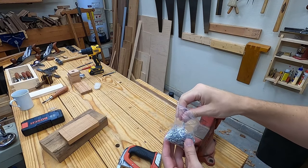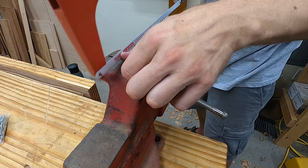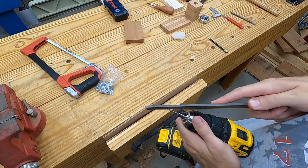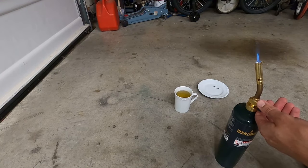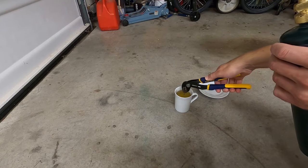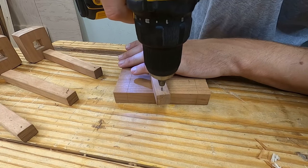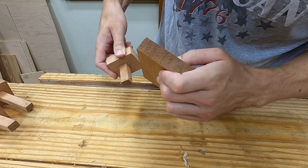Now, to make the pins, I'm going to use these carbon steel pieces. I'll put a link in the description for what I use for the pins, the thumb screws, and all the other hardware. I just saw it off with a hacksaw. Each of the four pins I tried shaping in a different way — I chucked it in the drill and tried several approaches. Then I torch up, heat the pin until it's cherry red, and plunge it in some vegetable oil. Tempering — which pulls out some hardness by baking in an oven afterwards — is really not necessary for this. I drill a hole at the end of the beam with an undersized 5/64ths drill bit, then insert the hardened pins. Does it work? Like a charm.